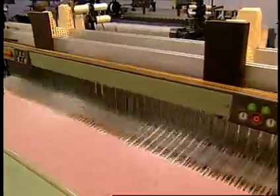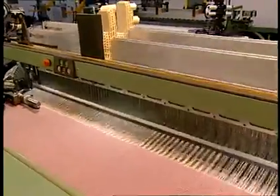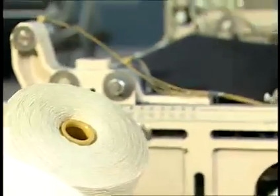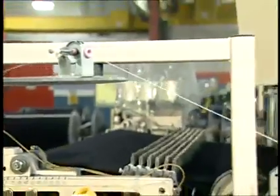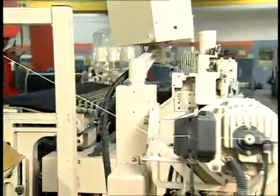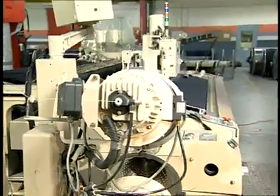The fabric is then processed in a normal manner. This would include desizing, preparation, dyeing if desired, and finishing. Unlike the warp yarn, most filling yarn is put onto yarn packages and delivered directly to the weaving machine, where it's inserted into the fabric without any wet processing. But sometimes dyed filling yarns are used to achieve a different looking denim.